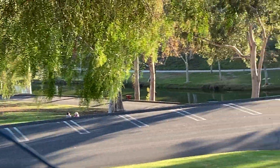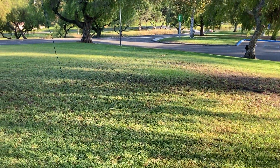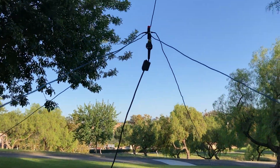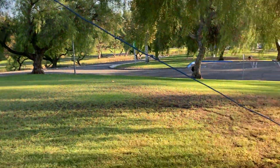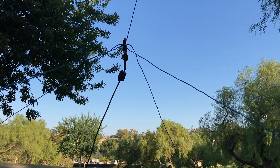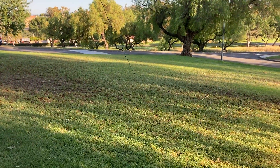You can barely see it, but there's a small freshwater lake nearby. That little lake probably won't make a big difference — it's not like I'm right next to it. There's also a freeway on one side, but that doesn't seem to bother the antenna. The radials are pointing north, south, east, and west — they need to be perpendicular to each other. If they're not, it's not the classic definition of a quarter wave ground plane antenna.